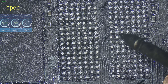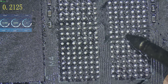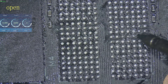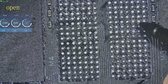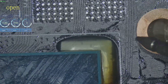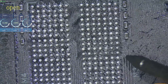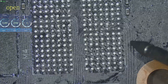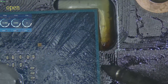This time, before rushing back into re-balling, I measured all the data and command lines. I found that two command lines from B1 weren't actually making contact with the GPU core. Those command line pads run under the GPU core near the same area as the A0 memory bank. That means we were probably dealing with broken solder joints or even broken pads under the GPU core itself. At this point, there was only one way to confirm it — I had to lift the GPU core.